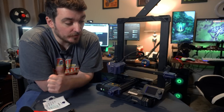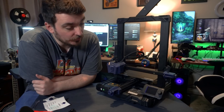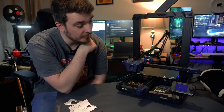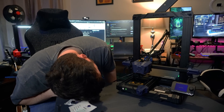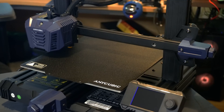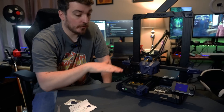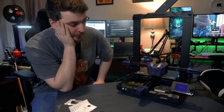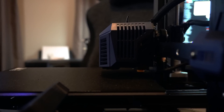One of the really nice features on the Cobra Neo is the auto bed leveling. When I started getting into 3D printing with the Ender 3 back in about 2019-2020, I would have killed for bed leveling built into my printer. This feature used to only be found in commercial and industrial printers, but now companies like Anycubic have brought it right down into entry-level machines. It really takes a lot of the pain out of getting your bed level and getting your prints to stick to the bed properly. It's heating up the extruder to 120 degrees and the bed to 60 degrees — measuring at its expanded state — before it uses the inductive probe to build a mesh data table showing where the bed is up, down, tilted, or slanted, then adjusts the nozzle height as it prints.